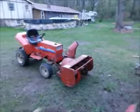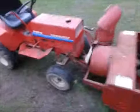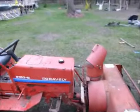The nice thing is it's real simple for me to change between the snowblower and the front drive kit. All I have to do is switch out the lower lift rods and unhook the front latches and just back away. The u-joint stays on the tractor part, and I just get it close, push it in by hand, line up the u-joint, and it's real simple.